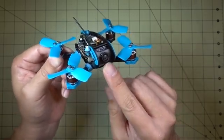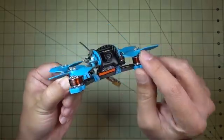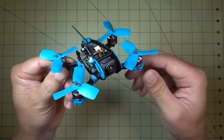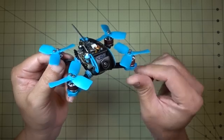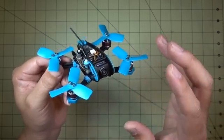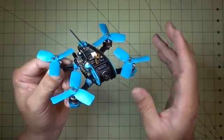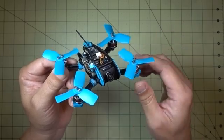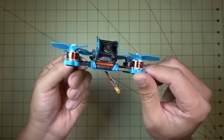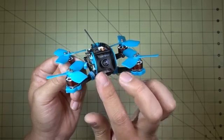There are a lot of these new micro CCD cameras coming out now that are similar in size and form factor to the micro Swift or micro Arrow, with similar image quality characteristics — as you'll see in the FPV footage. It's not quite the same as a micro Swift; the saturation levels are a little higher. But the light handling seems pretty much identical — very good — and it's definitely a CCD sensor at 600 TV lines. If you wanted to swap this out for a micro Swift, you could — it should be the same width.